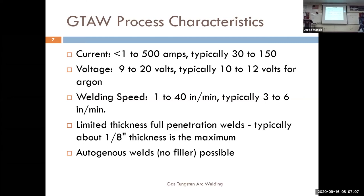Our amperage or current is typically around 30 to 150 amps, but machines are capable of going up to 500-plus amps. Voltage is dictated by how far away you are from the metal — that's your arc length — and we want to be somewhere between 10 and 12 volts. If you start going above 14 volts you're getting way too far from the metal. While you're welding, have your partner read out your voltage — it's the only number moving on your machine's display.